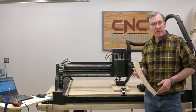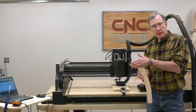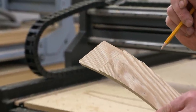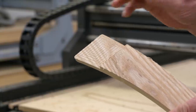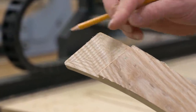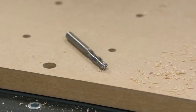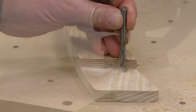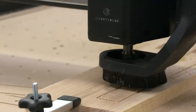We've completed the legs and the seat. Now it's time to produce all the uprights, which go into the mortises cut on the seat and will hold the crest rail. There's a lap joint where the crest rail will sit, and all parts in this project will receive an eighth-inch roundover. To ensure a nice tight fit in this lap joint, I need not a 90-degree angled cut but rather a fillet. So rather than using a quarter-inch straight bit, I'm using a quarter-inch ball-nose bit. I've got the machine set up to cut pockets on two parts, then I'll change to the quarter-inch straight to cut the outside profile.